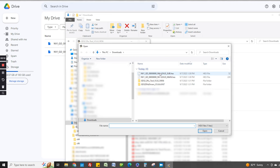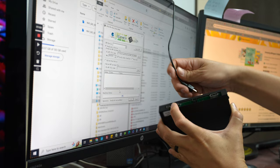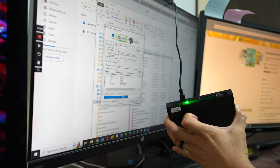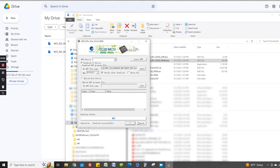That's for Main. Now do the same for Sub — load the Sub file, verify it, and plug into the Sub connector which is towards the inside of the box. Select Verify After Download and press OK. This one will be much faster.